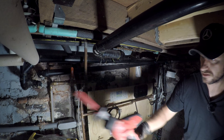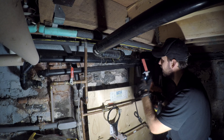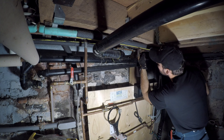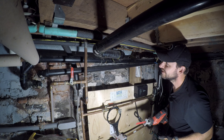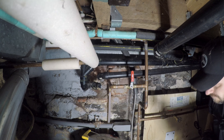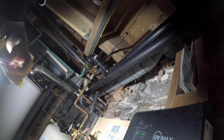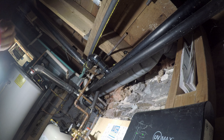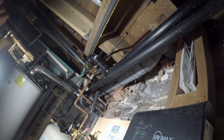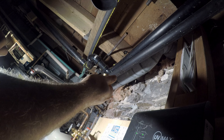Brand spanking new metal blade. I'm going to try and carefully cut it right here. If I can't get it I'll have to disconnect it, float it, and cut it nicely. There's some rust in there. All right, so that gets that side. Now I'm learning just like everybody on here — unless you're a plumber you're probably making fun of me, but first time using these SharkBites. These are the ones with the caps on the end and it's my understanding you just get it in there and push it on.